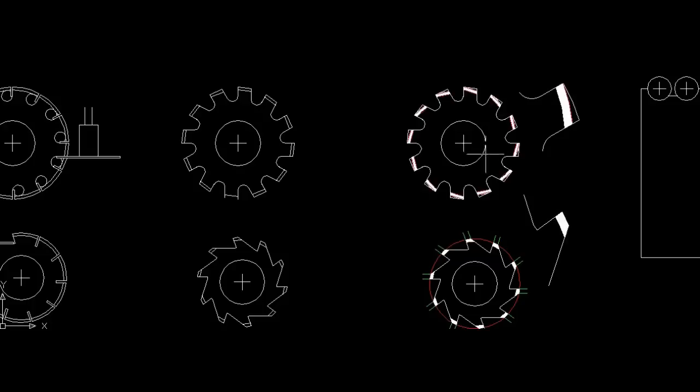With the Eureka tool, you get a cut that looks like this, and you're using a button tool like that to cut it. And you get a cut that looks like that. But between the two cutters, there is a little bit of an opening here, so you do find that you have an area in the back here. Now that has to be cut off with a flat cutter, and in today's demonstration, I will be using the flat cutter and not the button tool.